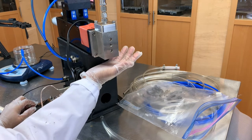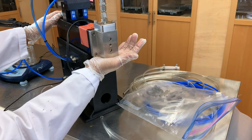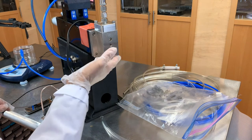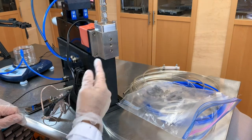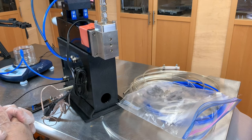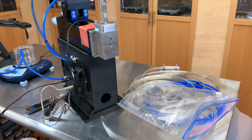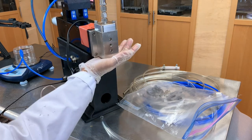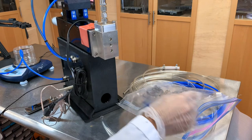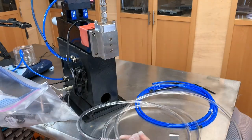On the input, you want to find suction like that. Don't do that without a glove. That's just one of the troubleshooting things you can do when you find something's not working. If there's no suction here, then you know the problem's somewhere past here. But if there is suction, then you know it's in your lower check valve.